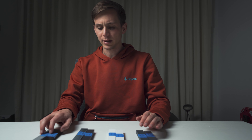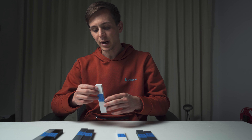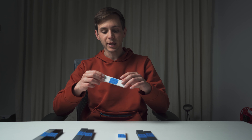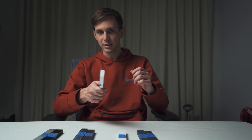I printed out each of the plastics. I decided to go with a five or six inch by one inch by half an inch sample. I ended up doing one horizontal and one vertical just to see if there's any strength change for how I need to print certain parts. This should give us a good test because I'm planning on using a shell of three layers and an infill density of 10% for the plane.